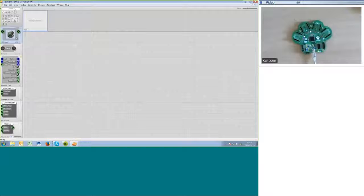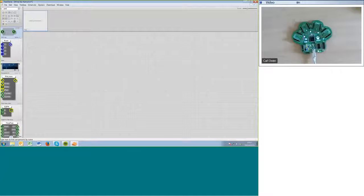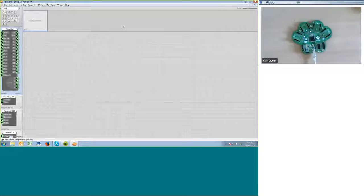In FlowStone, in order to do that, we have the FlowPaw module. If you just search for paw in FlowStone, this is my FlowStone project. I can blow that up a little bit if it helps. There we go. This is the software emulation of the hardware. In most FlowStone modules, you have the inputs on the left and the outputs on the right. Here there are things like start, LED inputs, and servo speed, and on the output side there's whether it's on or off, information, the 4 button outs, the 4 analog outs, the 4 digital outs, and at the bottom these 4 claw connectors, which connect to a range of claw modules.